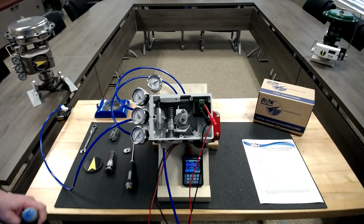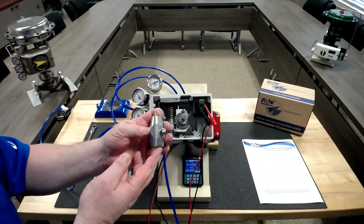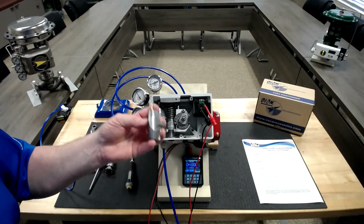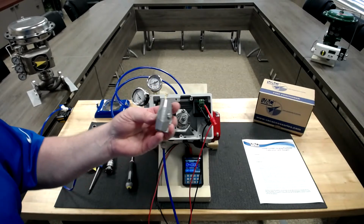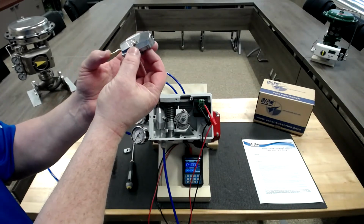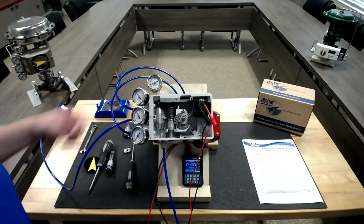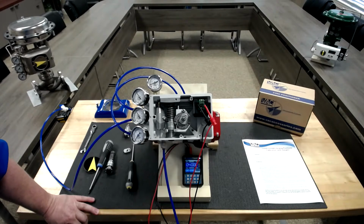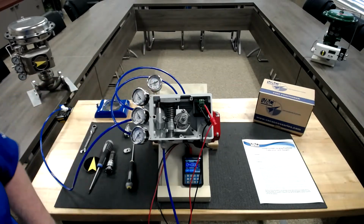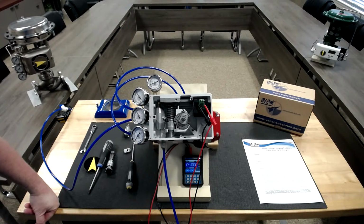Dick, we went over this a little while ago, but we'll go over it again. The 2 recommended spare parts are, 1, the pilot valve, which we have a spare sitting on the side, and 2, the I to P, the current to pressure transducer that's mounted inside the unit. Generally, like we said earlier, the pilot valve can be cleaned. The test to see if it can be cleaned is, as you're holding the pilot valve, if you turn it up about 15 degrees, the stem should slide out and move freely. If not, you can remove it and clean it with isopropyl alcohol or some type of alcohol-based cleaner or anything that leaves no residue. You never want to put oil, WD-40, tool oil, 3-in-1 oil, anything on the positioner itself. The other item is the I to P. So really only 2 parts that you would want to keep on hand, and you can keep this unit running.